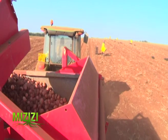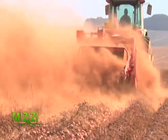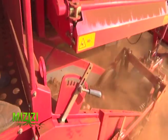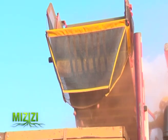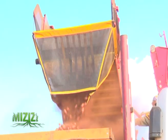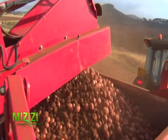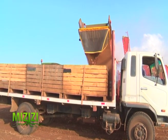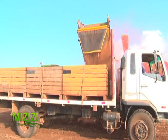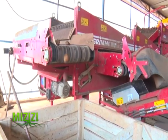The potato harvester was repaired and work resumed shortly. Potato harvesters work by lifting the potatoes from the bed using a share. Soil and crop are transferred onto a series of webs where loose soil is sieved out. Workers remove any unwanted matter picked up by the machine, and the harvester loads the potatoes into one-ton boxes on a trailer before they are transported to the sorting and grading area.